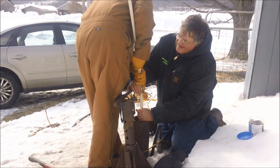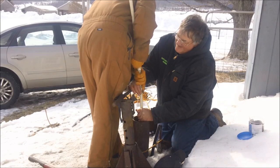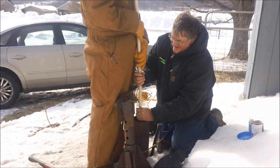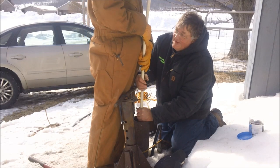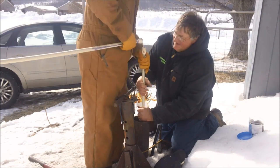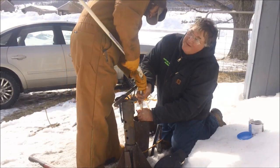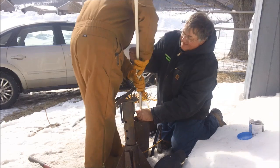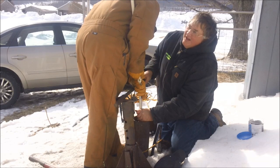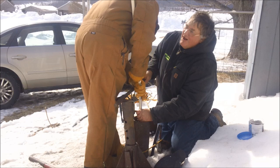I hope we have those sections. We had a 140-foot well and I've got 140 feet of this stuff, plus another 8 feet from that short section. We better have enough — if not, we can swipe it off the other. This means we have a well. If we can salvage this and get the pump down there, if we can get this cut off, I'll drop the pump right in there. If we're down far enough where we have a couple feet of water, we have a well.